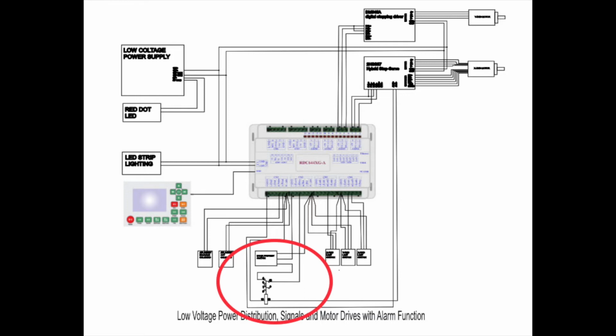The top contacts of the relay, you'll notice, comes from the door protect contact pin 3 of CN2 through the relay contacts at the top and into the door protect switch. So the way the system works is if the alarm is activated, the relay energizes, opening that circuit, which is the same as the door protect switch opening. So now we've got a way of detecting when either the stepper motor fails or when the door sensor switch activates. So the question is why exactly do you need this?